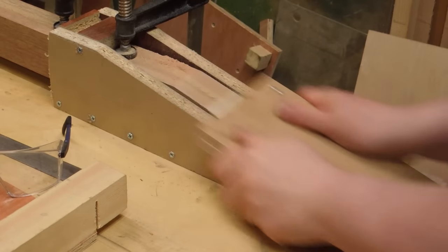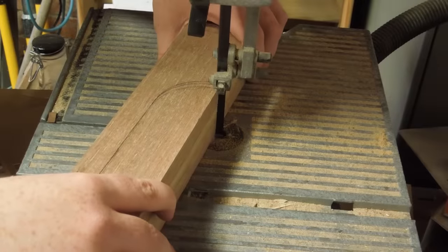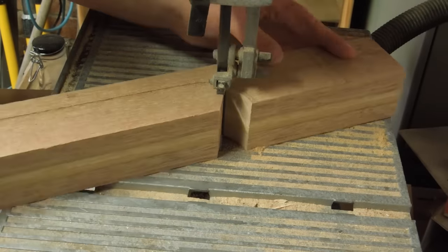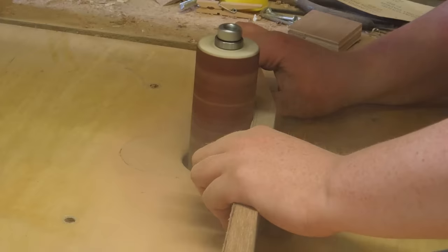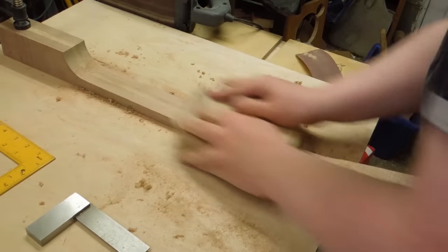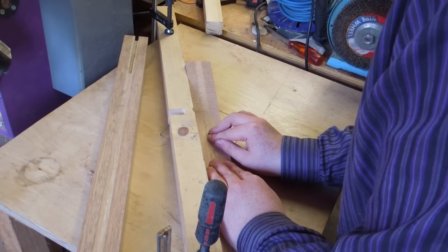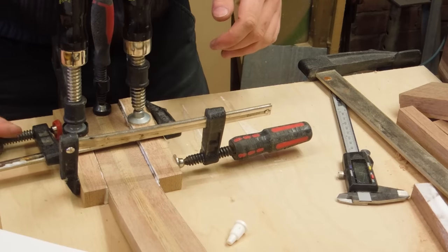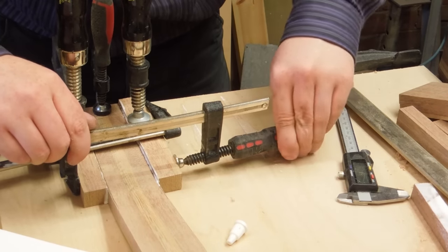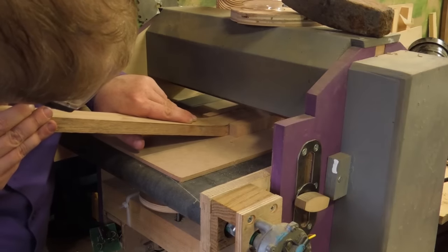A little box was made to sand the headstock angle — an idea borrowed from Fletcher who has some great videos on making guitars. I then cut to the line, or as close to the line as I dared, and used the drum sander to get the curves. For the back of the neck I brought it down very carefully with a sanding block. I also routed the channel for the truss rod, then glued extensions onto the headstock since it wasn't wide enough. I thought it would be clever to match the grain of the wood but didn't have any bits big enough. The back of the headstock was then thicknessed in the drum sander.